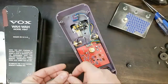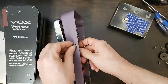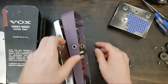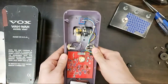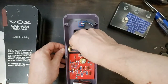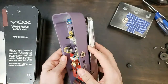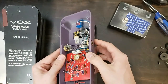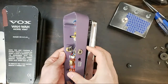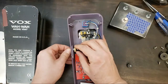I'm going to put this washer on and tighten this up. Whenever I'm tightening any input or output jacks on gear, I try to keep the ground point of this as close to the other ground points, and keep the hot contacts away from ground if possible. It looks like this is pretty tight in here — I would guess this is how it was set to begin with.